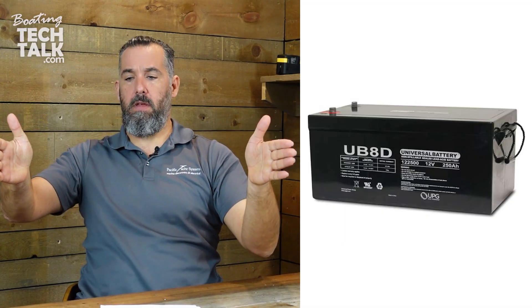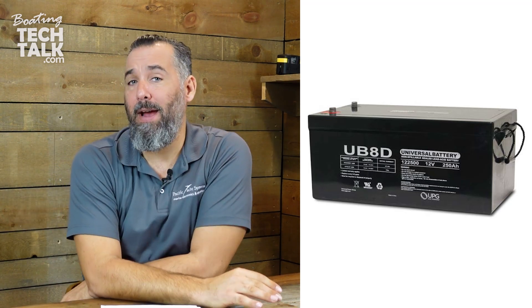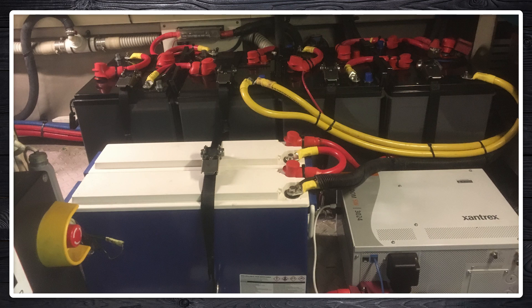Sometimes, and we see this with a lot of builders, you're thinking about, for example, an 8D battery. An 8D battery is about this long, this wide, this high. That battery might weigh 160 pounds — probably 60 to 70 kilograms. That's a heavy battery. And so a lot of builders, including ourselves, said, well, that's inhumane. How do you bring a battery of that weight on a boat? Yes, it's a battery and it meets the requirement of one battery being better than two, but how are you going to move that battery into the engine room when it's hard to get to? So a lot of times we're building larger battery banks by having smaller batteries, and they become building blocks for a larger battery bank. In an ideal world you'd have one battery, but realistically on boats, we often wire battery banks with parallel and series connections because it's a convenient and realistic way of bringing all that weight into a really hard to access location.